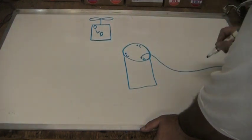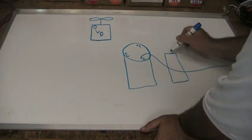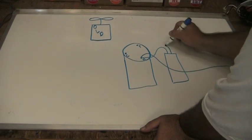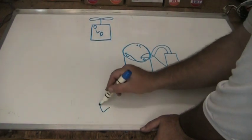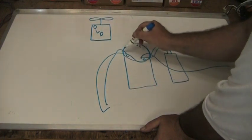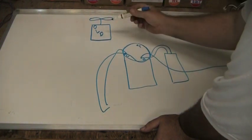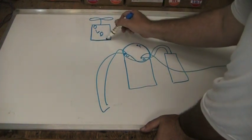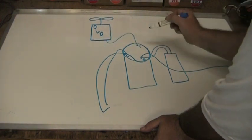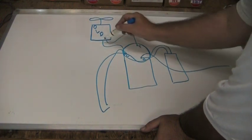You'll have a wire coming off the hermetic terminal, and let's say we had a super booster on there also — one wire went to hermetic and one wire went to common. We also have some additional wires feeding into common. Then we have three wires coming off our old fan motor: one goes to the terminal marked F or fan, and one goes to the terminal marked C or common.